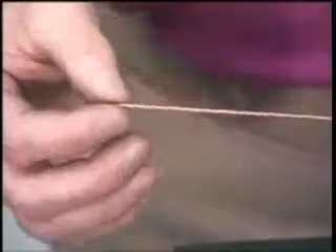We're going to weld these two small coupons together, giving ourselves a 16th to a 1/8 gap using a regular copper-coated mild steel rod. If you've got MIG wire, just take that. We've also used farm fence wire, hay baling wire, coat hangers — the old standard reliable standby. Just a standard mild steel; the copper coating helps it flow a little bit better and it doesn't seem to stick as much.